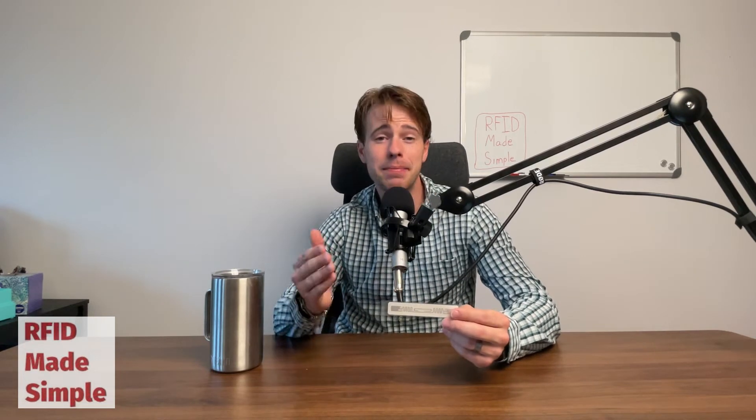That's where the M comes from at the end of the unit of measurement we use to measure RF — the DBM. Regular DB refers to straight decibels, which since we're measuring frequencies in the electromagnetic spectrum, measures the intensity or strength of the frequencies being transmitted from the radio or the RFID reader. But the intensity of the frequencies doesn't tell us how the chip is actually getting its power. That's why scientists and engineers created the unit of measurement DBM — decibels per milliwatt — which references the decibels or intensity of the frequency in reference to a form of power.